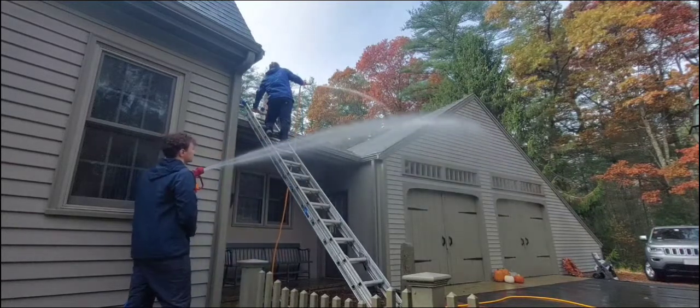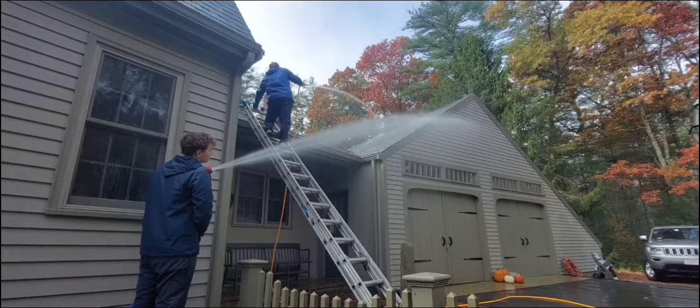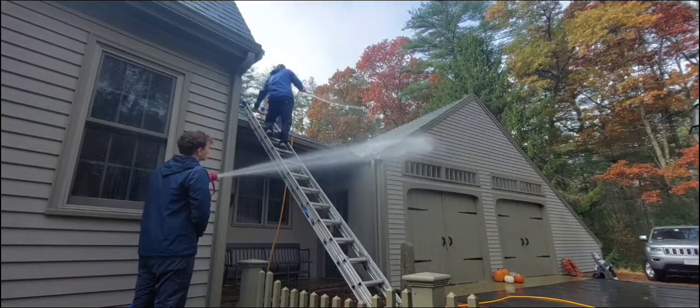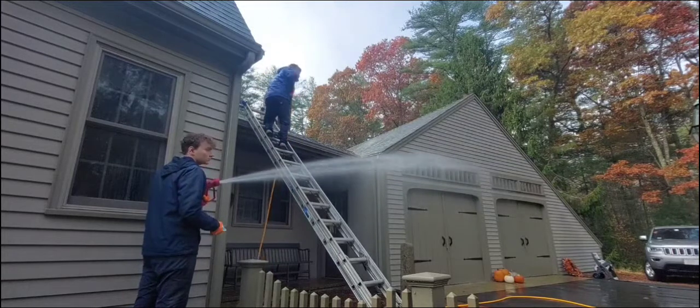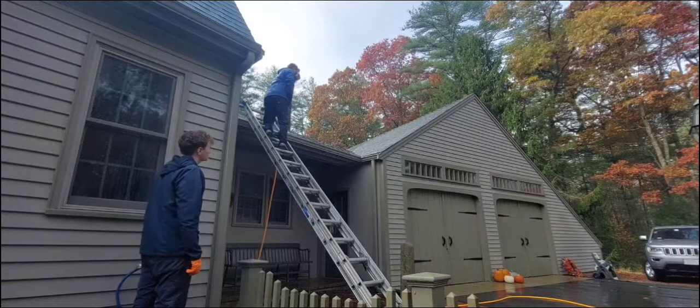You really want to keep your driveway wet and all your siding wet so you don't have drip marks going down the siding from mist or overspray. And always — like we have painted siding right here — always do a test spot to save yourself. We're also going to be taking a closer look at this soft wash pump from the Soft Wash Factory this weekend.